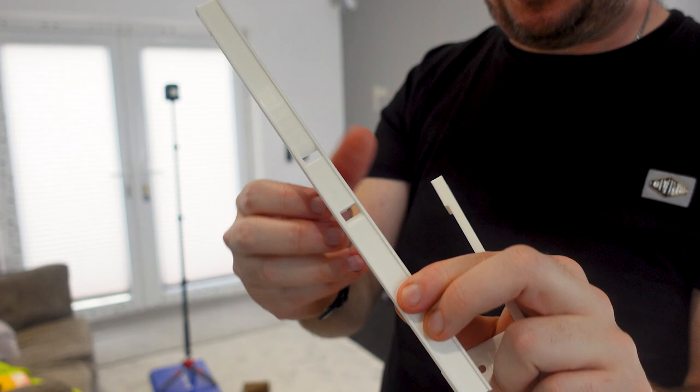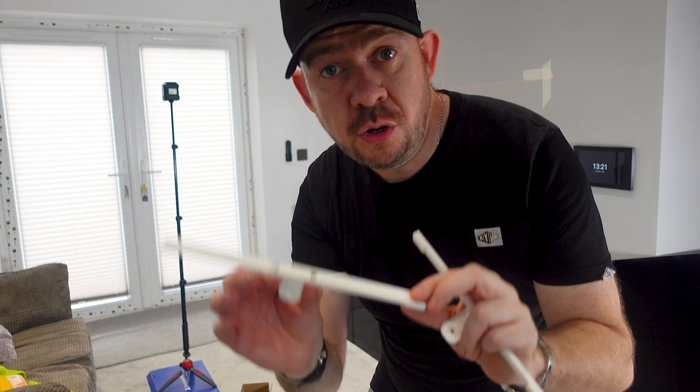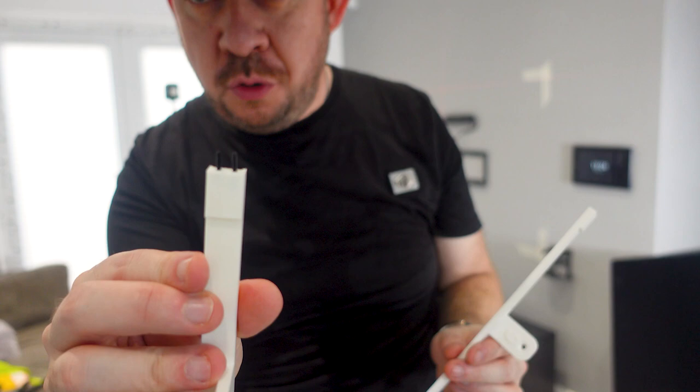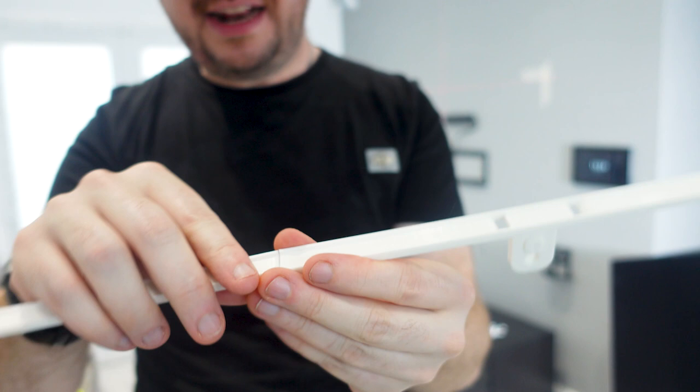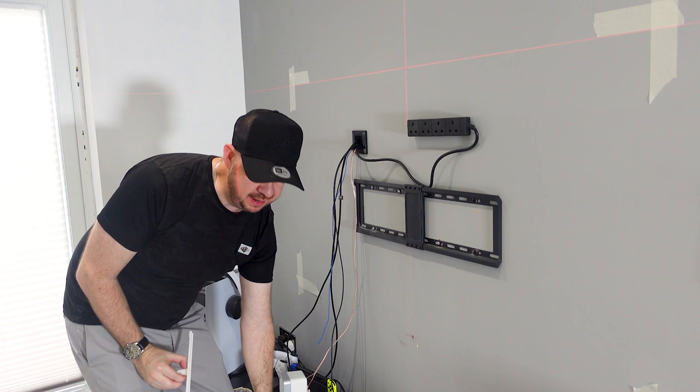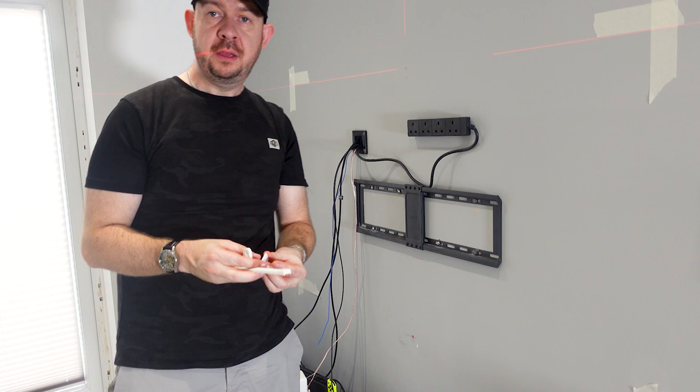The six pieces have two extra little holes to allow an in and an out for your LED tape wiring. You can mount them either via screw holes to the wall, or just stick the sticky pad to the back and stick it on the wall — which is how we're doing it today. I've put two bits of filament in the end and they just push together, which allows you to guide it all in as you go around building your piece on the wall. I'll start with the six piece and use a little spirit level to keep it neat.